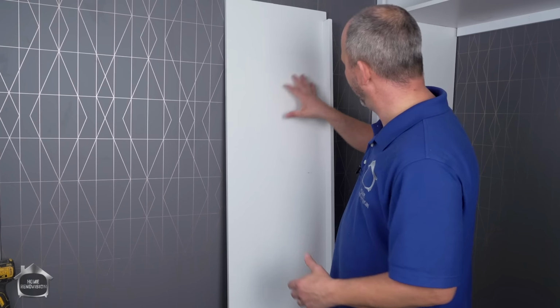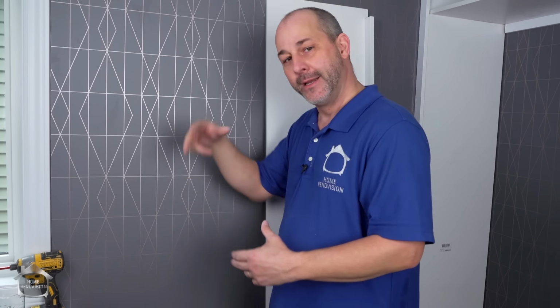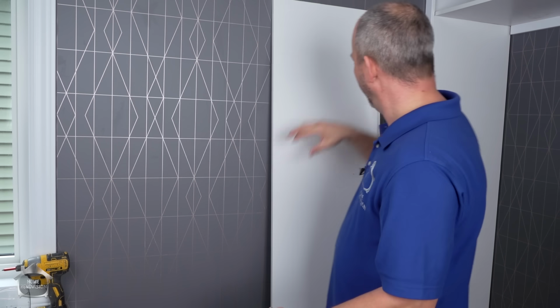Beautiful. We actually moved that vent because it was under the window, and so the dresser was in the way. So we moved it with the design in mind to keep that available to heat the room. So what I'm going to do is take this panel that I have my 1x2 attached to now, and get the floor to ceiling panel. I'm just going to put them all in position, screw the 2 main panels together, nail this one into the wall. Bam, we've got an end gable and it's fixed in place.